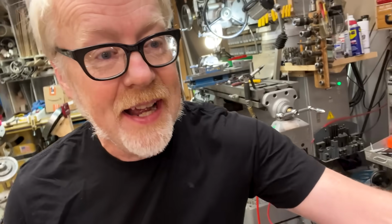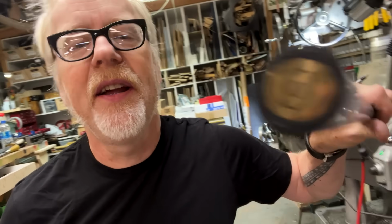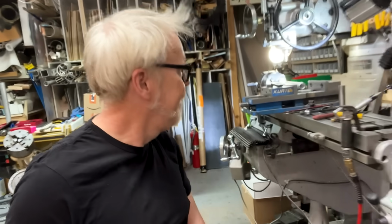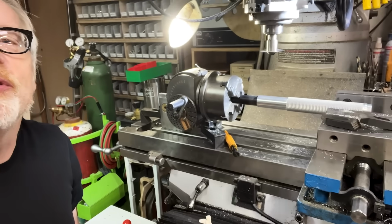The issue that I have now is that I have to work out a really solid way to hold on to this blade. You see the blade has a commutator on it, and there's pins out of the tip of the machine, and they have to meet, which means I have to lock the blade in. But this blade is made of plastic. They said use 3 set screws, which I'm sure is fine, but I don't want to do that. So I am actually going to build a pressure system for this out of individual leaves at the end of my lightsaber handle. And I have set up my mill here to achieve such a thing.